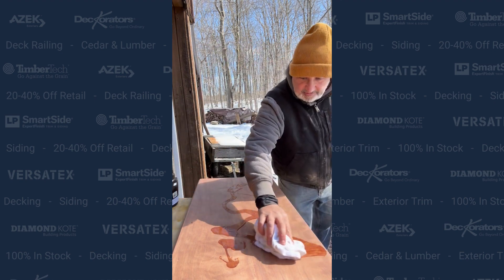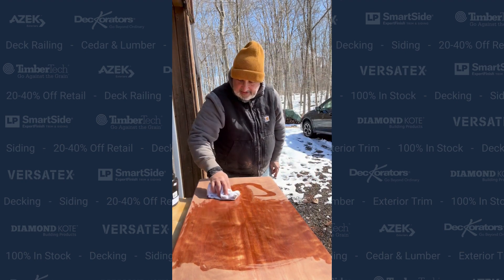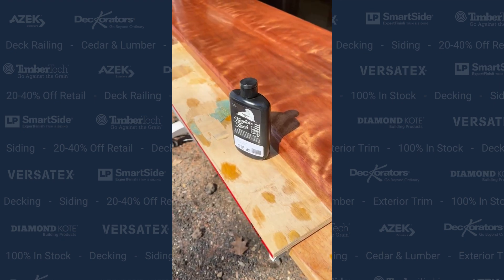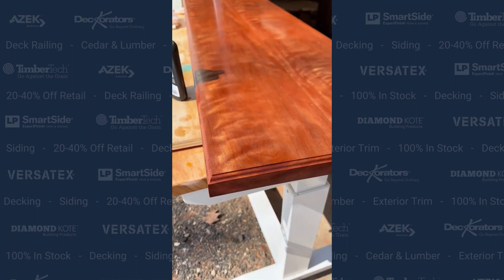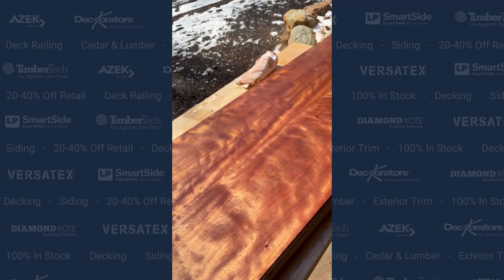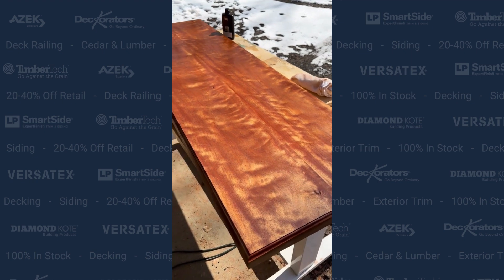And of course I got a little bit of a tilt here. Isn't that stunning? It's important to rub that oil in. You can put multiple coats on here as well. I'm going to put a wax finish on top of this. Even though it may look a little glossy right now, it is a matte finish. So if you want any kind of a glossy finish to this, you need to really buff up the wax and you can achieve that. But all by its own, it is a matte finish once it soaks into the wood.